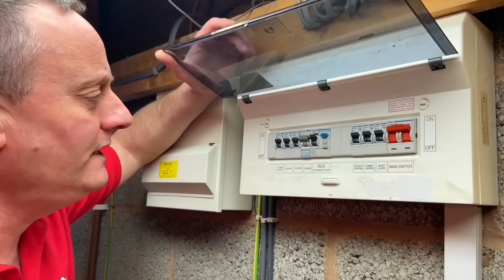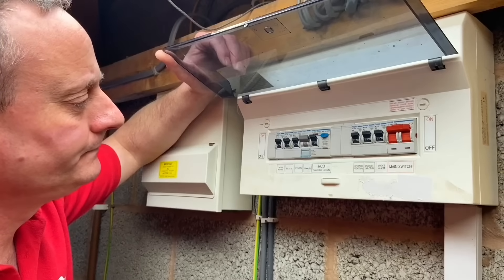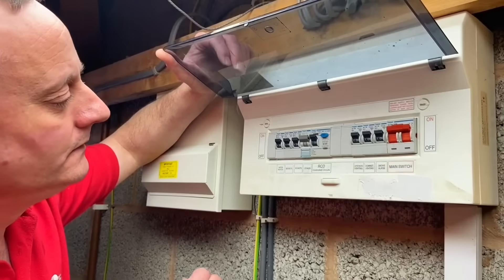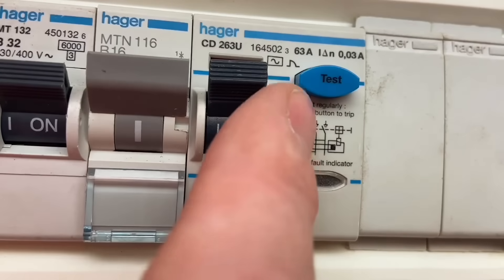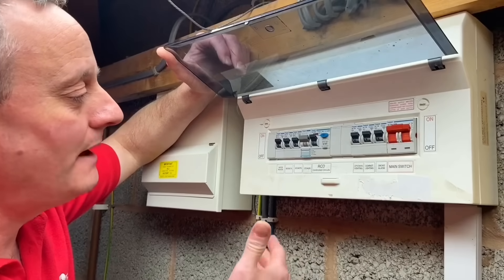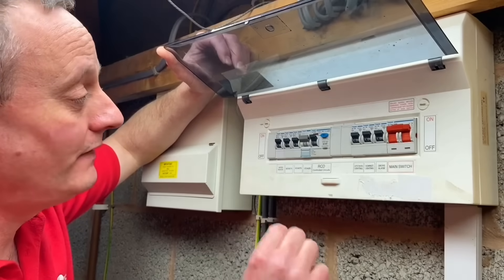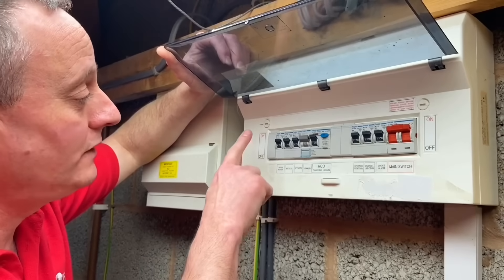Any issues if I come off the RCD side, Joe? What we need to ask is what type of RCD is that? There's not automatically a problem with coming off the RCD side, but we do need to know what type it is. Looking carefully, I can see a sine wave indicating this is an AC RCD, and we know it's a hot topic in the electrical industry — where you've got potential DC leakage in a circuit, it can confuse AC-type RCDs. So straight away I'm thinking it wouldn't be a good idea to come off from this side.